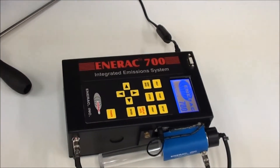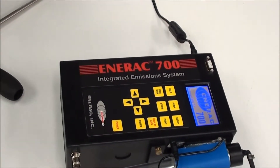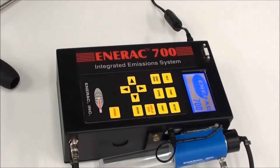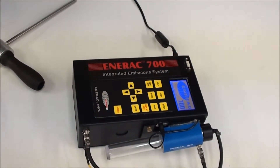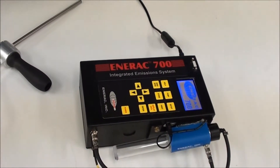What's recommended is to let it run for about five to ten minutes before we do an auto-zero on the instrument. Auto-zeroing will take a reading of all ambient levels of gases and temperature and set that as the zero point. You want to make sure you're in a clean environment when you do the auto-zero.